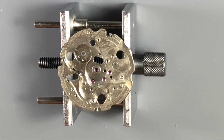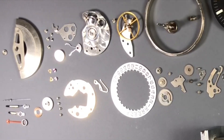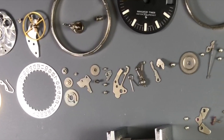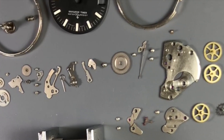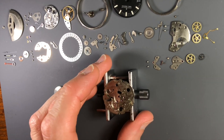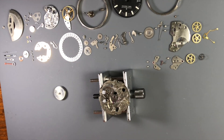Let's back out and take a larger look at things. Here is a good look at all of the components. Really all that's left to do is take the mainspring out of the barrel, give it a good once-over, and get it cleaned up. We'll get the barrel itself cleaned up and make sure there's no irregularities with the mainspring. I don't see anything here that's of any concern — all the pivots look really good, the jewels show no cracks, chips, or abrasions. The arbors on both the main plate and the barrel bridge look good too. This should be a stellar runner — it should run as good as it looks when we're on the other side of this.